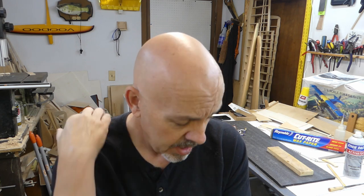A little bit more complex than expected, absolutely, but it was not difficult — it's just a matter of taking time and trying to do it right the first time. So the next time you see me back down in the shop, we'll be getting everything prepped for paint on the Stomp. I still have three more coats of dope on all surfaces minimum — it might be four, but right now guaranteed three — with the last two being filler. Then at that point, just start shooting paint on it. I'll see you guys next time back down in the shop.